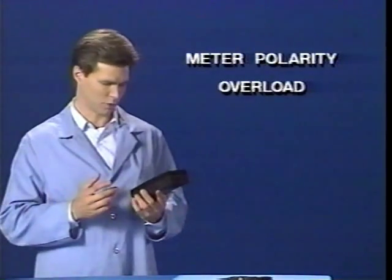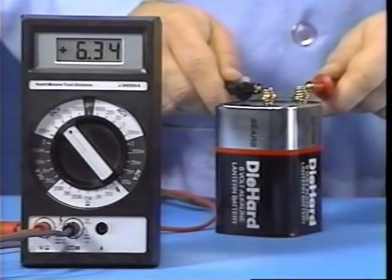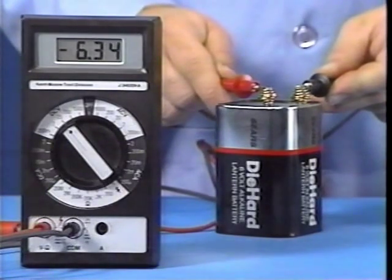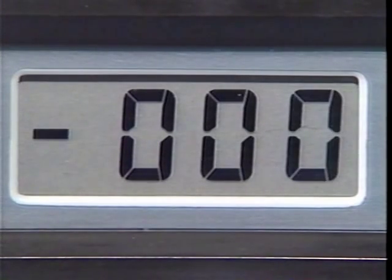This DVOM's digital display indicates meter polarity, overload, battery condition, and circuit continuity. Polarity refers to the positioning of the meter in a circuit — connecting the positive test lead to power and grounding the negative test lead results in positive polarity, while reversing the test leads gives a negative polarity reading. An OL appears on the meter display to signal an overload if the input signal is greater than the range setting. This feature allows testing in circuits where unknown overload conditions might exist.